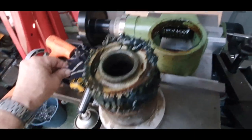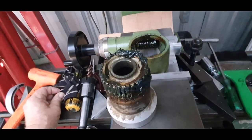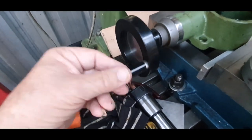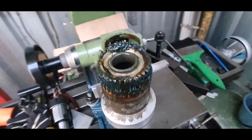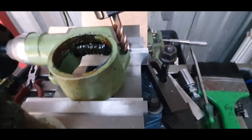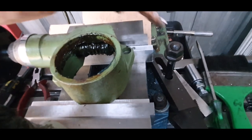And then that'll take the excess slack out of it. That's what I'm hoping to do. Instead of having a quarter of a turn on the wheel where it would just slack from there to there, this way I can adjust it so it's only a couple of thou. So what I'll do is I've got this 14 mil end mill — that will come into here, go in there, elongate a fraction, and then that'll be spot on.